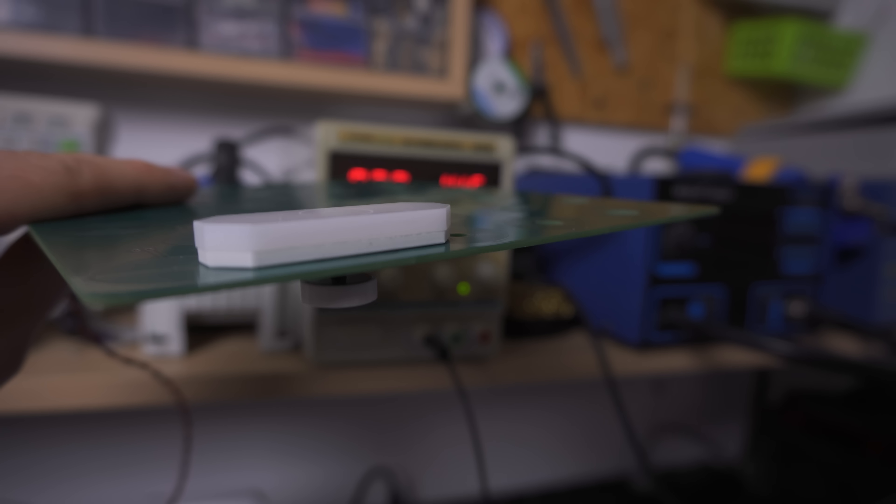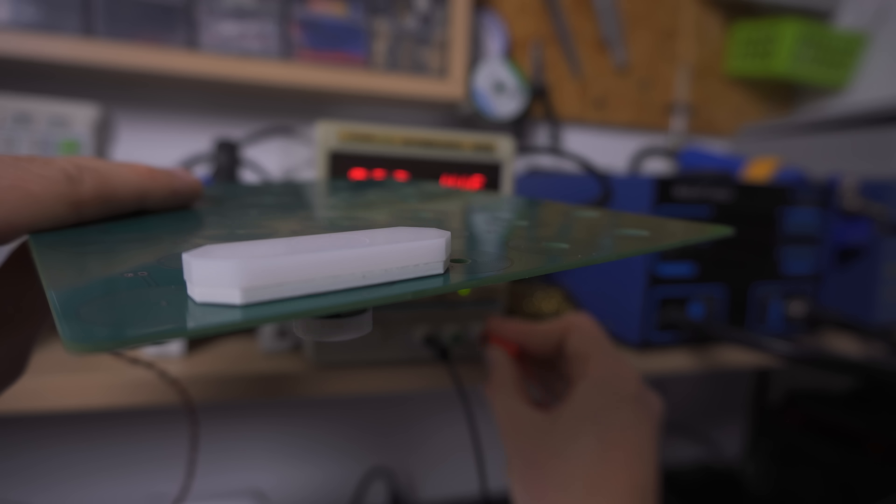The movement is generated by an electromagnet built into the PCB. Running current through the coil attracts or repels a permanent magnet attached mechanically to the segment. By happy accident, there's a hole in the PCB at the center of each coil — totally unused before, now super handy. It lets the magnet sit under the board and gives the moving segment two support points to prevent jamming.